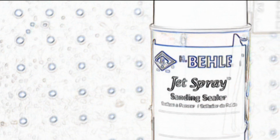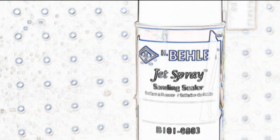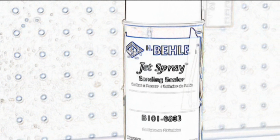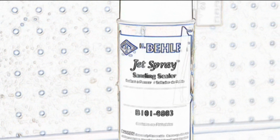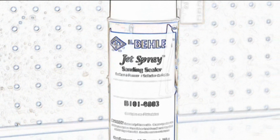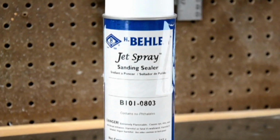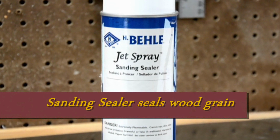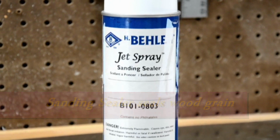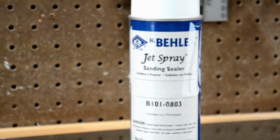We've chosen Behlen by Mohawk as our preferred vendor for this project. These cans of nitrocellulose lacquer, sealer, and color toner are all excellent quality and very good bang for your buck. You can find these online at a lot of different retailers. The first step, we're going to apply our sanding sealer. This is going to seal the pores of the mahogany wood so that we can get a nice flat even finish, and it also prevents the color lacquer from being soaked straight into the wood by the open pores of the mahogany.